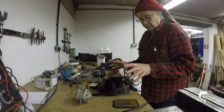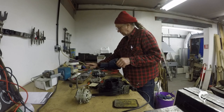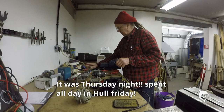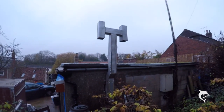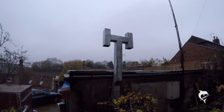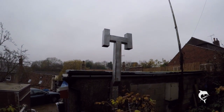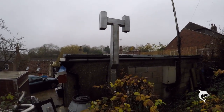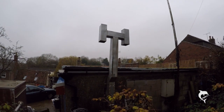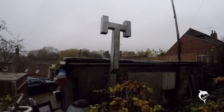That's part one of what I'm going to do to try and get rid of the smoke problem. Now, there's the flue we've got at the moment. As you can see, it's quite short and it's also got an H-pot on the top, which I think the air I'm blowing up the flue is hitting the branch of the H-pot and possibly causing some turbulence, and it's not clearing the smoke. So I'm going to modify that as well.